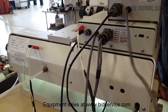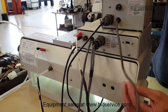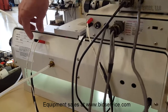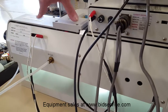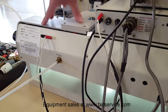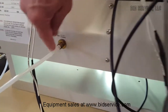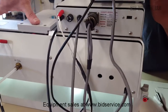I just want to discuss the utilities on here. We have a 110V outlet required for your temperature controller box, and another 110V outlet right here that's for your power supply. You'll notice that the red and black wires here are used for ball bonding, so we just left them on there, though we don't have the head for that right now. This is convertible, so you're able to do ball bonding, 90 degree wedge, or 45 degree wedge bonding. The other utility required is a 50 PSI airline — there are a bunch of pneumatic valves up top here that are used for the bonding process.